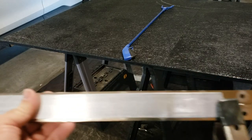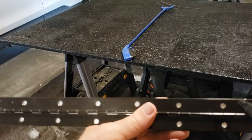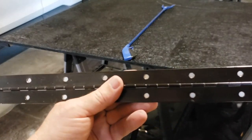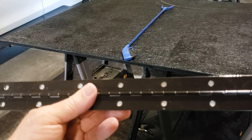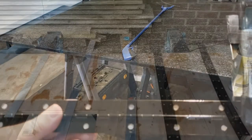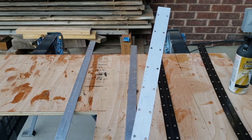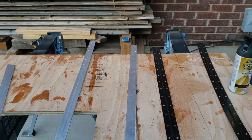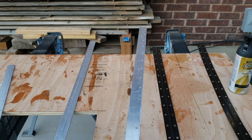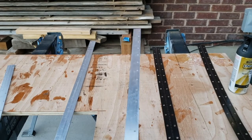I just clamped this onto the bottom side of one of the hinges that I'm going to use, and then I'm going to mark the holes where I want to drill. That way the holes will be nice and uniform, and they'll be spaced the same as the hinge so it'll look like it belongs there. This one is going to go across the centerpiece that's going to be stationary, so I'm going to be attaching it on both sides. And these two will attach to the side of the box covers. Since they're going to be opened like this, they're only going to be attached on one side — and that's the box lid.